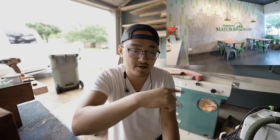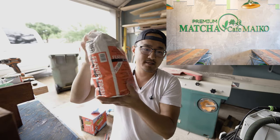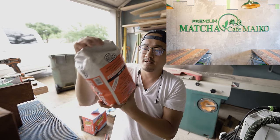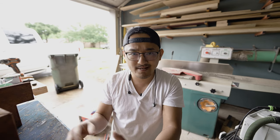That reminded me of this project over here. I worked on it about five years ago and I did a concrete wall finish that wasn't really concrete. I use this product called Ardex. It comes in two colors, gray and white — I'm actually going to use the white for this project. On that project I applied the Ardex feather finish right over gypsum board and it held up really well. And I also applied Ardex over MDF and that held up really well too. So for this project I'm just going to use plywood since I have some sheets laying around as scraps.